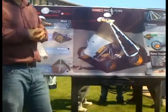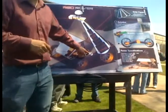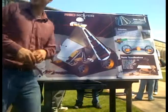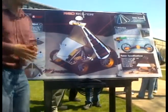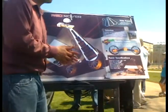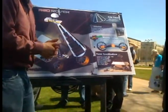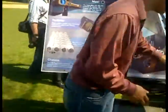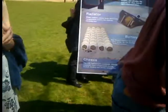What kind of motors? These are brushless DC motors. Brush motors don't work very well in space due to the vacuum. How do we get rid of the heat from the motor? We have a thermal coupling to the radiating surface, which is directly facing away.